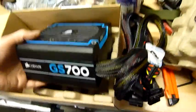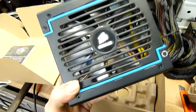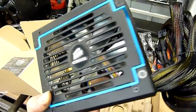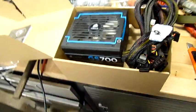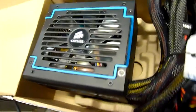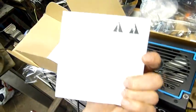This is a pretty neat looking power supply, it's a lot better than the ones I've had in the past. Never had one this fancy before and this is the cheaper model. There are some much more expensive Corsair supplies, but this one looks really good. From what I can see inside, the capacitors are mostly Nippon Chemicon. There are a few green ones in there which I'm not really sure about — might be Samwha.